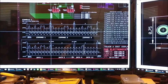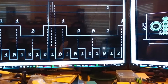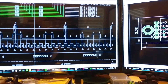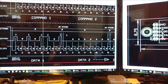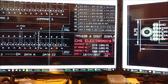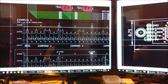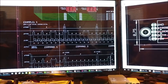When the clock is high you have to post the strobe quickly enough within that clock signal to load the command byte — you do this on the eighth clock for every command byte. For every data byte you send, you don't use the strobe — just send all 12 data bytes with no strobe pulses. Once all data bytes are sent, raise and leave the strobe high, ready for the next commands. Bring the strobe low first before sending commands, otherwise it will ignore everything.